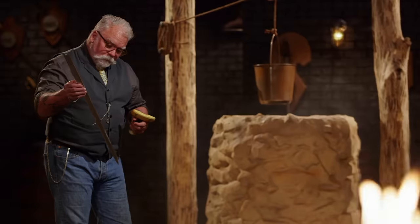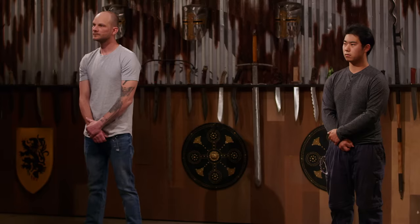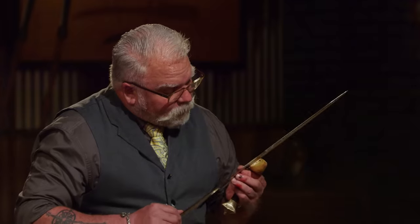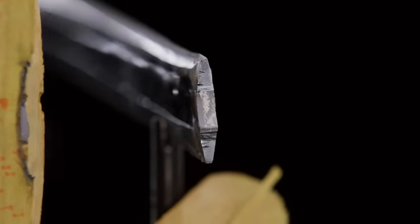All right, we were doing so well for a moment there. What actually happened was, with inletting your blade down into this piece of wood, any of that leverage was just too much for the wood itself, and it popped it loose. Your tang is a little bit small, but what I do like to see is that your blade actually held up beautifully. I mean, your grain structure looks fine. This is an absolutely brutal test. Very well done. Thank you.